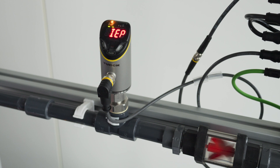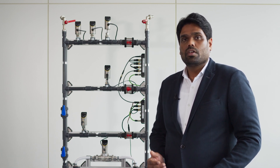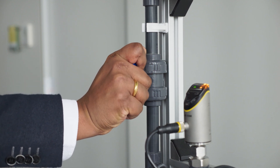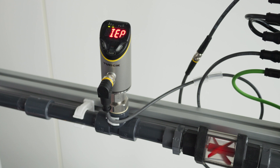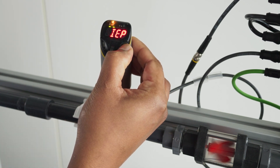This is our unique selling point, which does not let you do incorrect settings on the sensor — a very smart feature. Usually the flow is more or less steady after waiting for some time, so one may ask: why do I need delta flow monitoring? It could be that even after waiting, the flow may vary because of pressure variations in the system. For demo, I'm adjusting the valve to show such an event. Here you see that the delta flow monitoring is indicating this change in flow rate by blinking red again, not letting me save the flow rate at this moment.